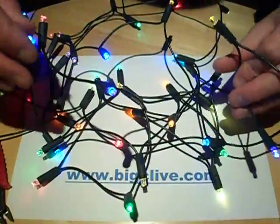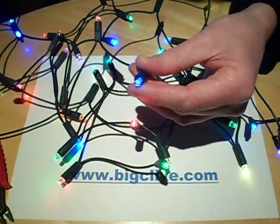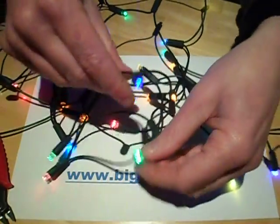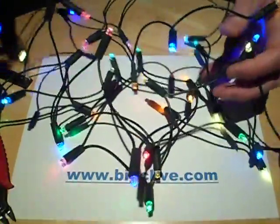Most of these LEDs I've 'cracked the ice' on — I have another video showing that. You basically use a pair of snips to crack the tip off the LED, which makes it viewable over a wide angle. It makes for a very interesting set of lights.